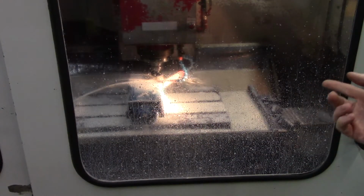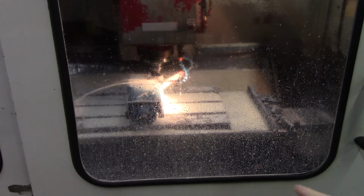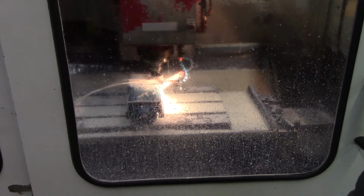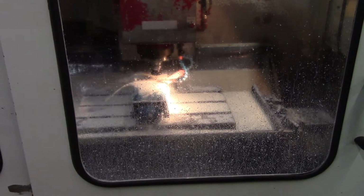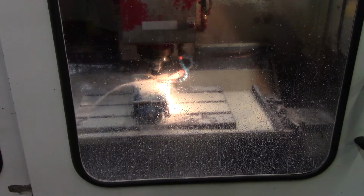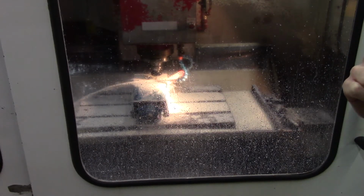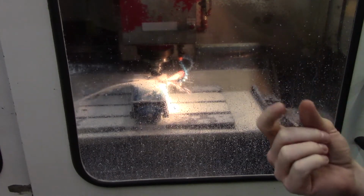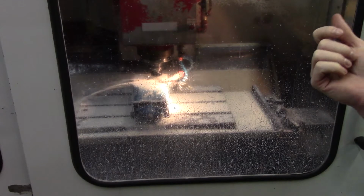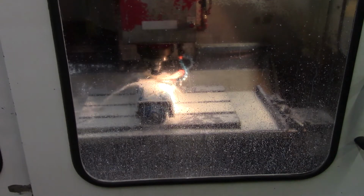Okay, this is running part number 2. I've increased the feed rate on the helical just to make these complete faster. I'm still not really running the cutter really hard. And these should turn out nice. The prototype one that I made works. I think the chamfer that I added onto the main hole will help center up the collet a little quicker when you set it in the tray.